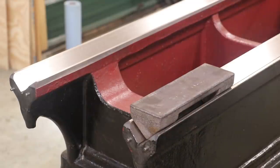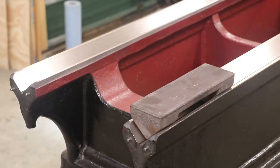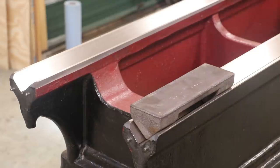So we're going to go over to the mill machine. First thing I think I'm going to do is get the top flat and that will give me a reference surface so that I can then start milling the other pieces on here. Once we get all that done, we will take it to the surface grinder and grind it to match what we have down here. Let's go, let's get started.